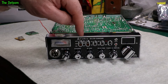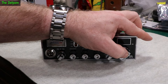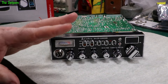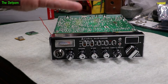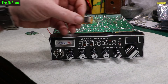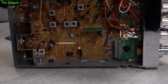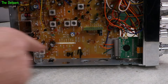I've been asked to look at this Cobra 29 Unlimited Chrome. This isn't the standard one — it's got AM and FM. There's a channel switch that pushes, because that's now an encoder, not an actual channel switch. I haven't come across this variant before. I expected to be installing one of my modification boards to convert to New Zealand channels, but it won't work because it doesn't have a PLL. This is where the PLL would normally be — it doesn't have one.